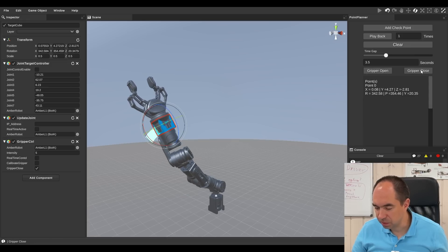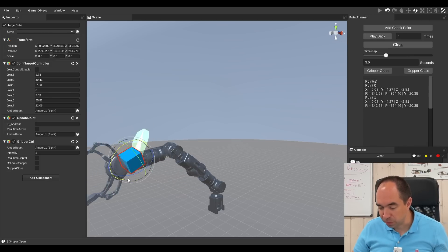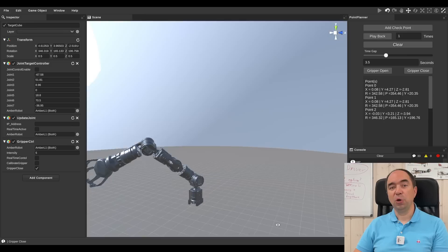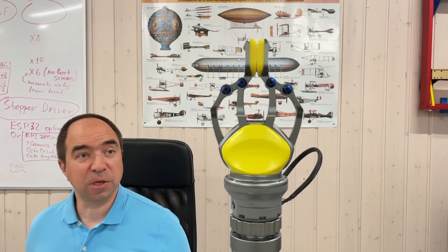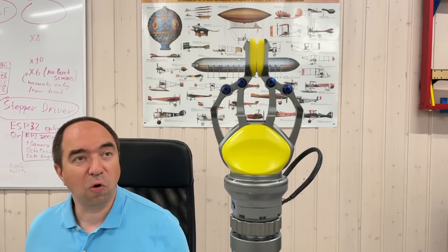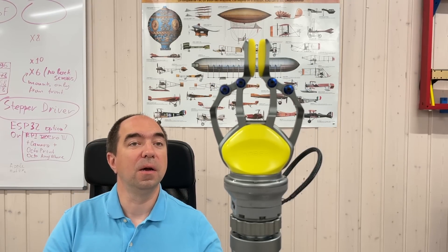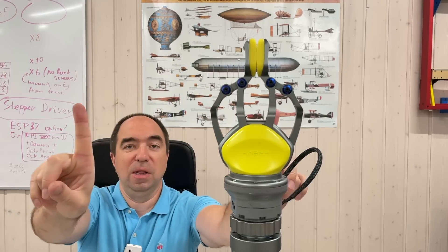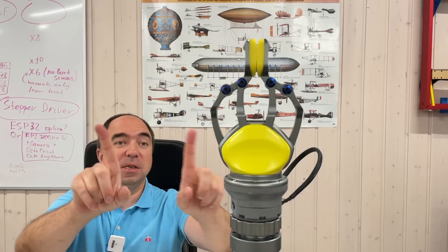We can close the gripper and open the gripper. With this software you can control the robot arm quite easily, and you'll also be able to program it using Blockly, with more features planned for the future. The fingers of the gripper move in parallel — not in an arc but straight — which is really important because parallel finger movement makes it much easier to grab objects.